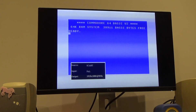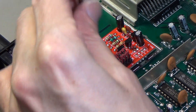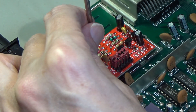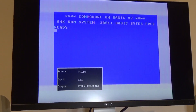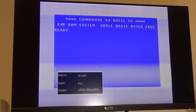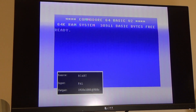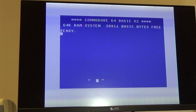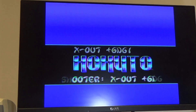It's working but it does already look better apart from the corruption. I'm just going to turn these right down because that's where it recommends you start. These are 20-turn trimmer pots - they were tuned for the C64C that had it in. Let's turn them right down. It's doing some horrible things. So let's turn up the chroma - I think it recommends to do that first. I'm just turning the luma way up now. That chroma thing's definitely working because it goes from unsaturated to more and more color as you turn it up. It's got this big rolling line going down it which is weird - I wonder what that's coming from.